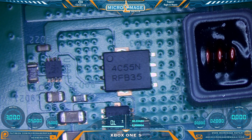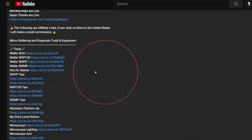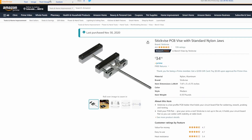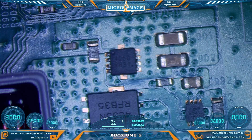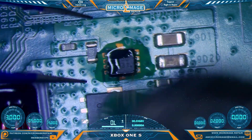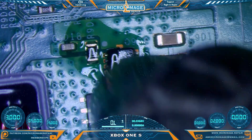I've already pre-tested this donor board to make sure it does not also have the 12-volt short. In order to remove the donor MOSFET I'm going to need to set up my equipment, and while I set up my equipment let me throw up my expected temperatures for this job. These temperatures are brought to you by the Amazon associate links in the description. Alright, let's pull our donor part. It'll take a tremendous amount of heat to work this board, so just be prepared.